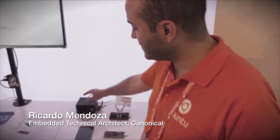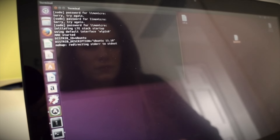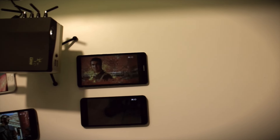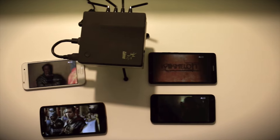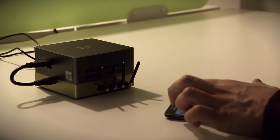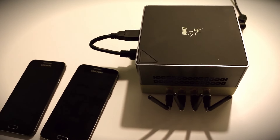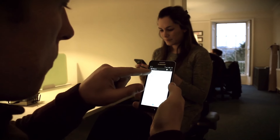This is also operating at the core of this box right here, which is running Snappy Ubuntu Core. From Snappy Ubuntu Core, one application becomes the LTE stack, so now you have an eNodeB or a base station basically at your home or enterprise premises, ready for use just by buying low-cost hardware and downloading an LTE stack from the store.